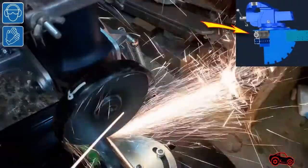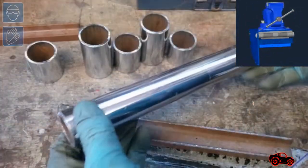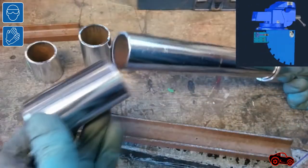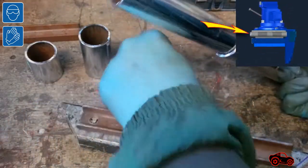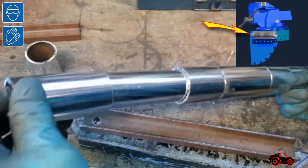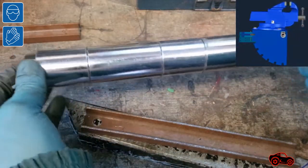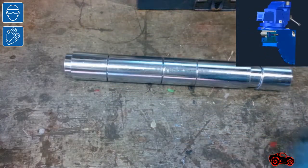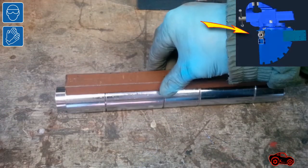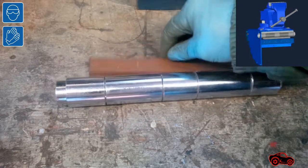The other important assembly I needed to do was the pivot hinge system. I used two fitting steel pipes as basic material. I prepared five short sections to be welded and used as knuckles for the pivot hinge system. I kept the smaller pipe to be used as a center pivot to hold and rotate the plate assembly.